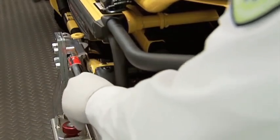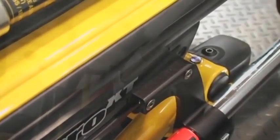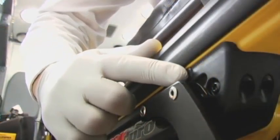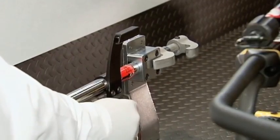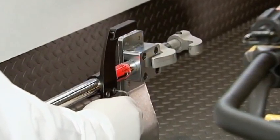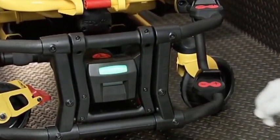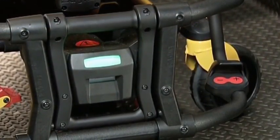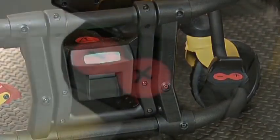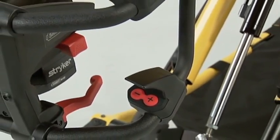Next, slide the in-fastener shutoff bracket along the rail clamp until the rivet on the shutoff bracket is aligned with the arrow on the cot's sensor panel. The cot's magnetic switch is behind this panel. Tighten the in-fastener shutoff bracket to the rail clamp assembly. Check to be sure the in-fastener shutoff is functioning by pressing the minus or retract button. If the shutoff is properly aligned, the motor will not activate but the battery indicator will light. Only test the shutoff with the minus button — do not press the plus button or you may damage the cot.